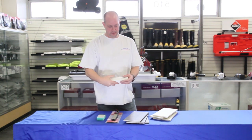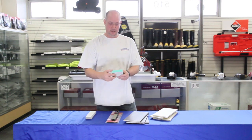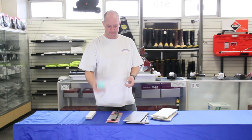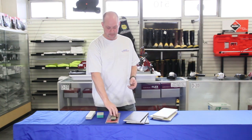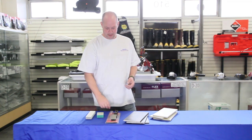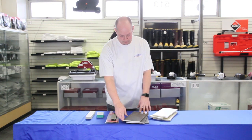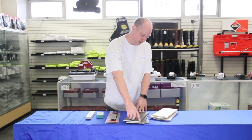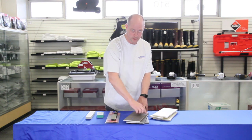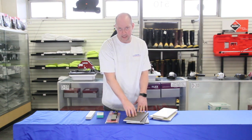We're going to look at the more traditional ways: a 60 grit white stone diamond resin pad, a 70 grit pad, and the Edgecraft diamond file, which comes with three different grits — we'll be using the coarse grit. Basically we're going to use these to put the bevel and smooth out this edge so that if it's meeting up against metal or whatever, you get a nice clean edge. We'll show you a picture of that after we're done.